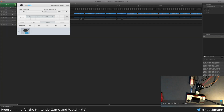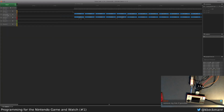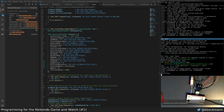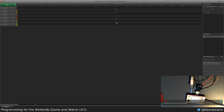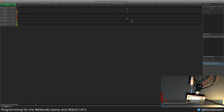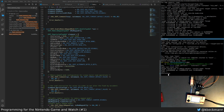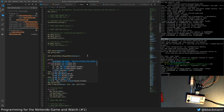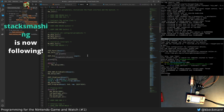do a full capture. So gonna sample for 1 full second and continue. So what do we get? We get 2 commands. The first command is 0x66, the other one is 0x99, nothing else. So that's good. That means that we're not getting any magical accidental reads. So what we can do here is that we can, let's do like this.